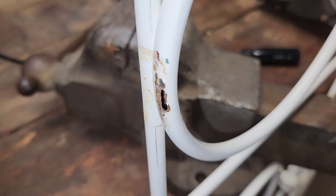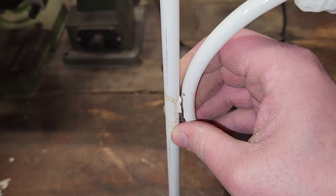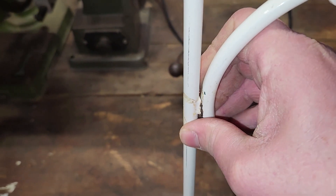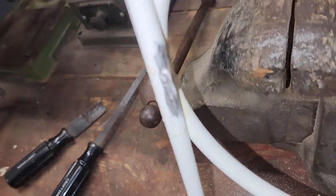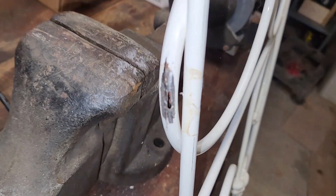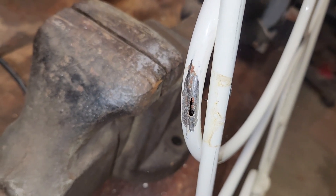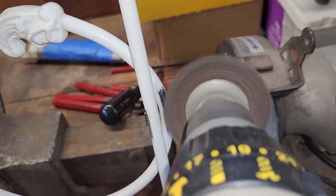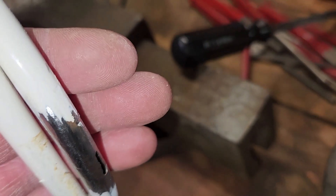The examination. Here I have a hole in this material. We've got a big old blob of weld right here. I think what I'm going to do first is get as much paint off of there as I can, sort of prep the surface. Filing went pretty well. Surface cleaned up. I gotta take care of that still. Do I need more prep? Do I need to remove more paint? I don't really know. We'll find out when I get a bunch of contaminants in the weld.